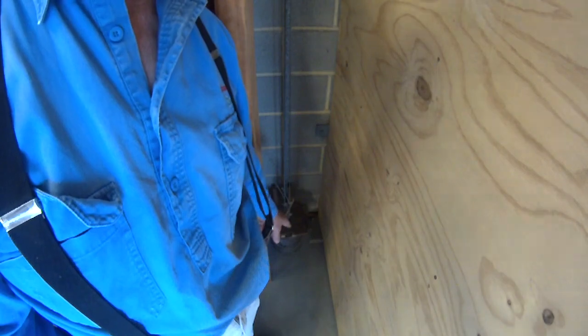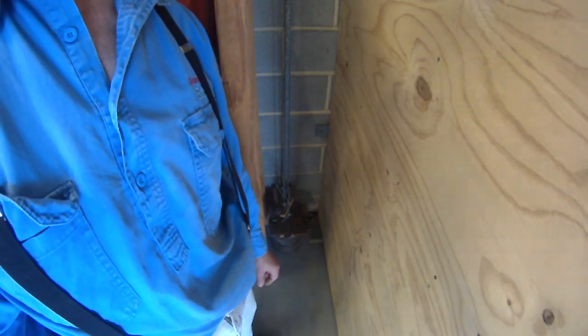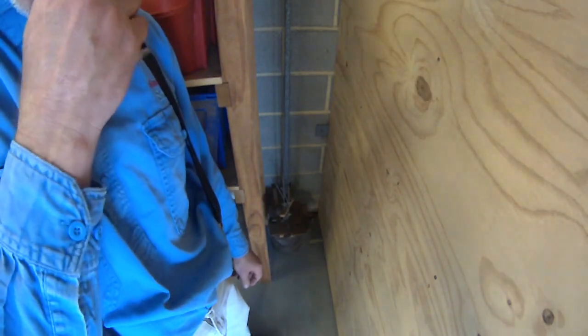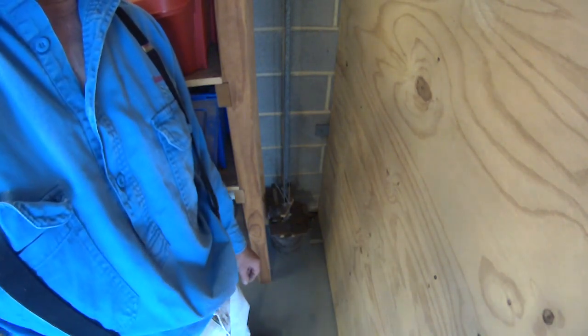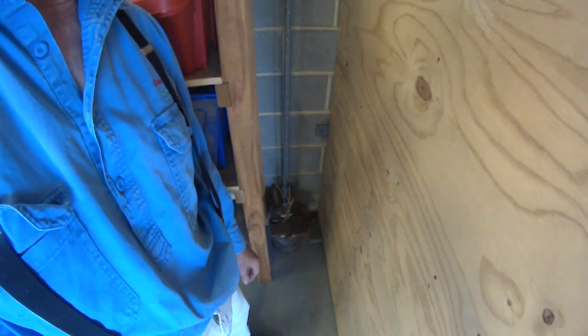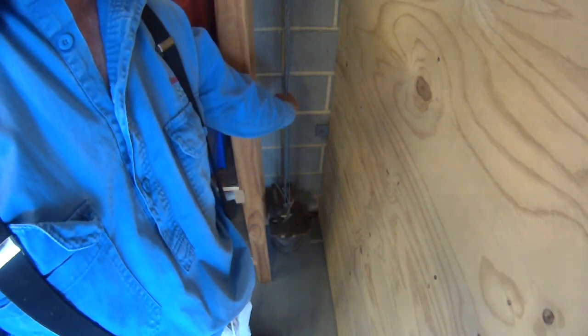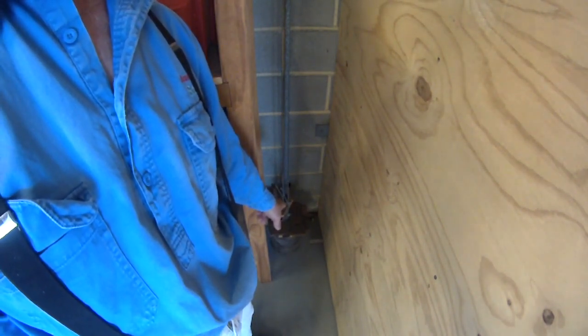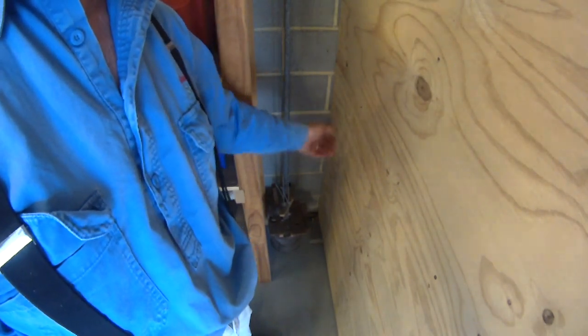That's my counterweight — you can see some steel plates on top plus a bucket full of lead. It's just a gallon paint can that I've melted lead into. The way I weighed it was I had the door all the way open manually, with a stick holding it up resting on a scale. The door actually weighs 35 kilograms at the bottom edge. That's about what this bucket weighs — it was a little bit low so there's some friction from the cables and pulleys. All that weight is about 37 kilograms, and that's what it needed to counterbalance the door. It's unfortunately one of the disadvantages of this design, but it does make the door very easy to open.